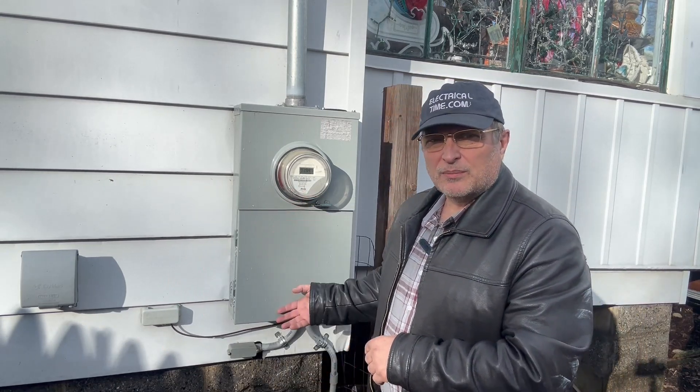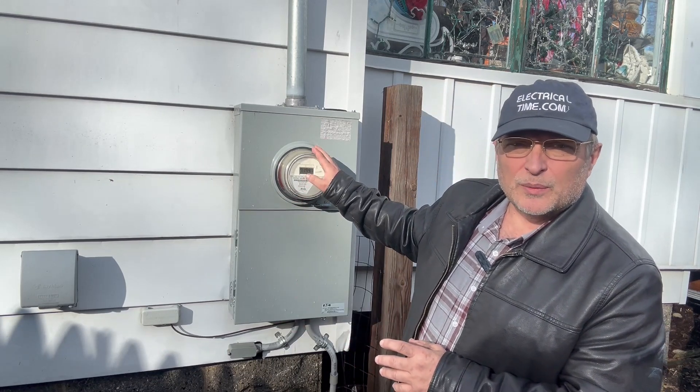The purpose — probably the most important reason — is that when firefighters come to a dwelling unit and want to turn the power off, under the 2017 and prior editions of the NEC it was perfectly okay on a one-family house to just have a regular meter. The service entrance conductors would then supply power to a main breaker panel in the basement. Firefighters had a big problem: they'd go into these houses and might be forced to remove the meter, which could be extremely dangerous, especially if it's under load.